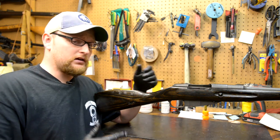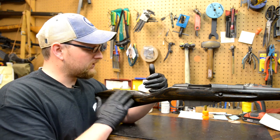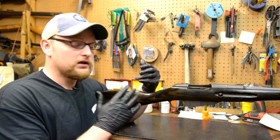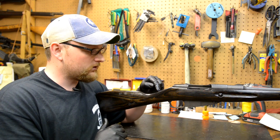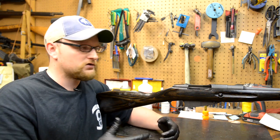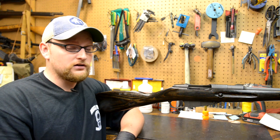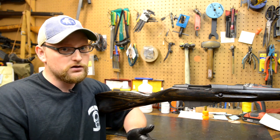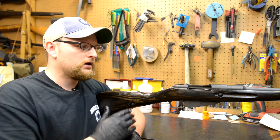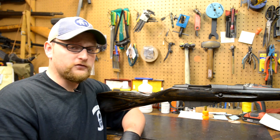If you're ever doing bedding work and it acts like it doesn't want to move, don't force it — give it a little time, hit it a bit at a time, make sure it's rigidly clamped up, and it should pop loose. We'll cover that in a later video. You're going to break it loose and you're going to have a perfectly fitted tang area for your Mosin, and the recoil lug is going to have lots of support, which is really going to enhance accuracy and keep that action from moving so much. I've actually got an ex-sniper rifle where we were shooting it with the bayonet attached, with iron sights, getting pretty consistent hits out to 450 yards, and all I did was work the trigger a little bit and bed the tang and the recoil lug. So in a coming video, I will show you how to do a really good basic job on your Mosin trigger. Thanks for watching, and you guys have a good one.